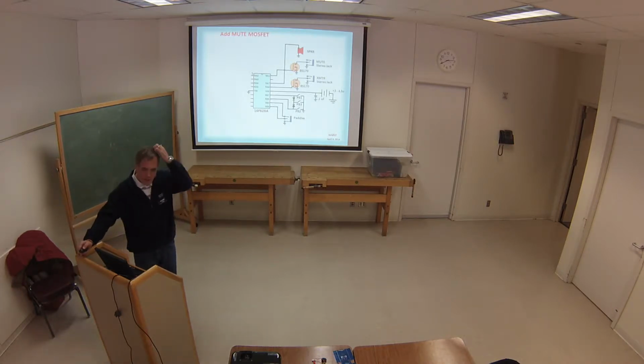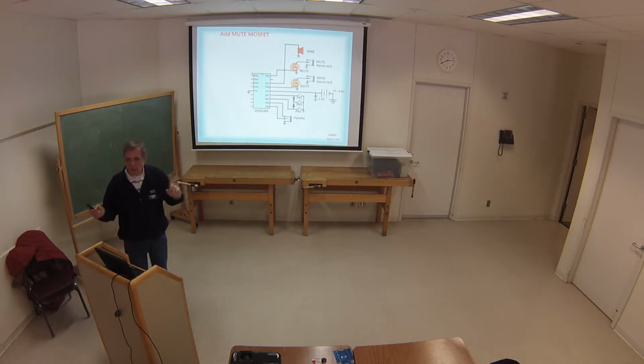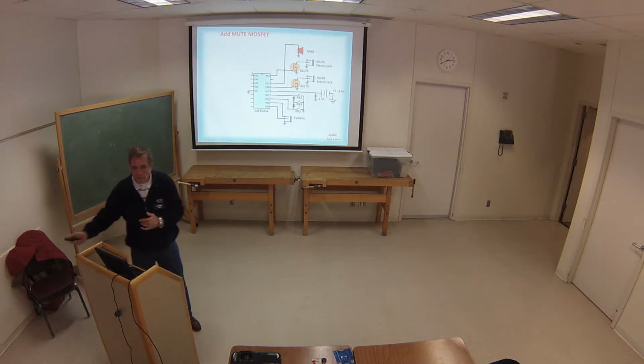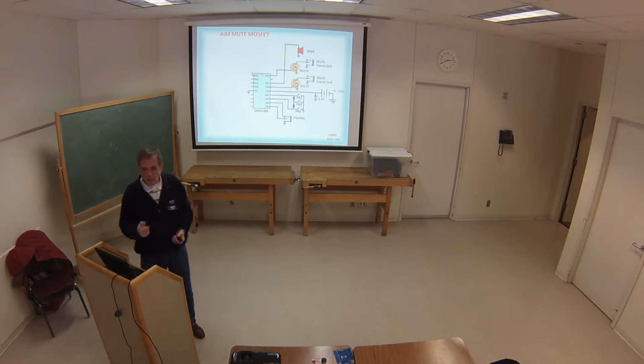The mute output is something that I really didn't think I would use, but he said there are enough people that make simple little rigs that want this. Basically what happens is when you key a dit or dah, it activates the mute 7 milliseconds before it actually transmits or activates the keyer MOSFET. And then at the end, it'll hang on to the mute 7 milliseconds after the keyer is released. What this does is get rid of thumps. It's a little TR mechanism for people that are trying to transmit and don't want to hear that thump in their ears, with very simplified circuitry.